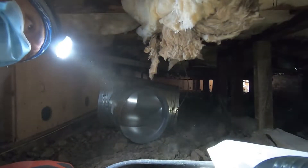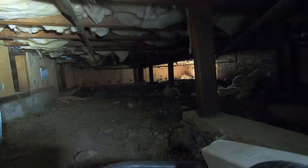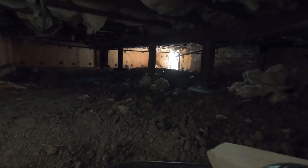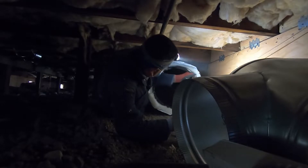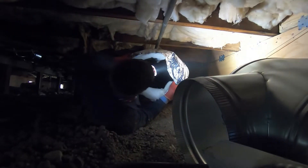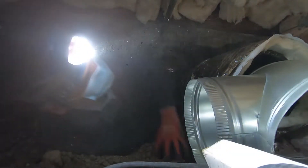The other fun part of crawling under the house doing duct work is that you have to pull your flex duct and drag your cans, tees, tools, and material — and you can only do it a foot or two at a time, which is really exhausting. What I do is drag the tee and the flex to where I have more headroom, then connect the flex duct to the tee after I finish connecting the main trunk to the tee, and then connect the two 12-inch return ducts.